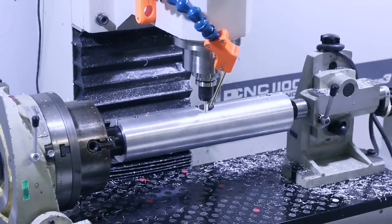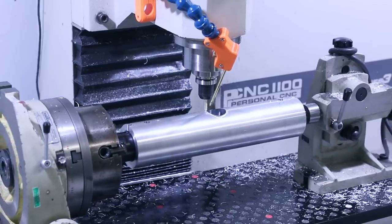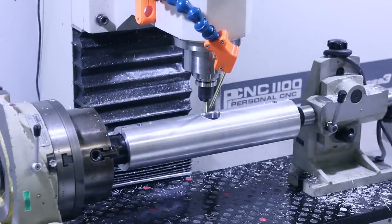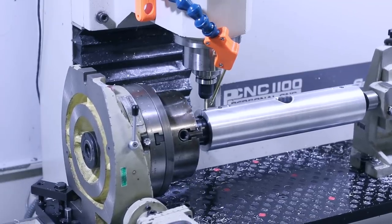This large hole is for the wiring harness to the track drives to pass through, so again, we'll want this corner to be eased. I'm using a ball end mill and a scallop toolpath to round that edge. And while we're at it, using the same tool to do some 3D scallop chamfers on these holes and slots.